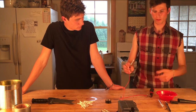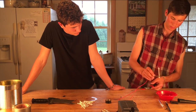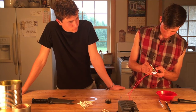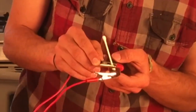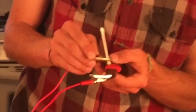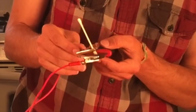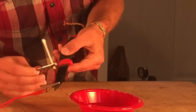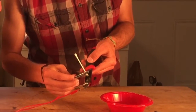Always remember to put the positive to the piece of metal you're working with and the negative to your Q-tip, because power flows from positive to negative. You can use a 9-volt battery for this — I'm using a 12-volt variable power supply, but a 9-volt battery will work great, maybe a little slower. I've barely touched this one and it's just taking the etching amazingly.